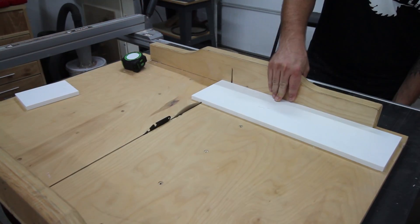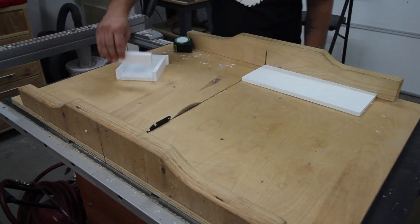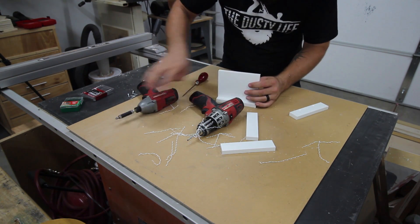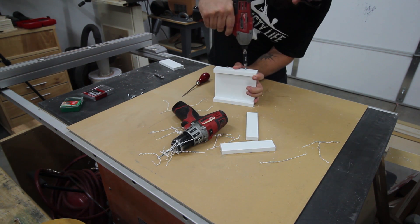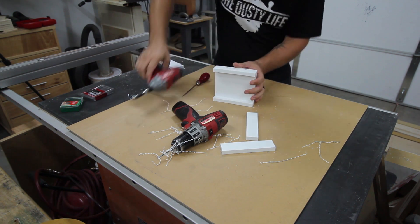Next, you'll need to make some forms to use during castings. You can try to use MDF or other wood forms and a form release spray, but I like to use HDPE plastic. It's not very expensive and there's not much that will stick to it, making the castings very easy to remove. Curtis from Turntex has some very good instructional articles for making forms and I'll provide the reference links on my website.